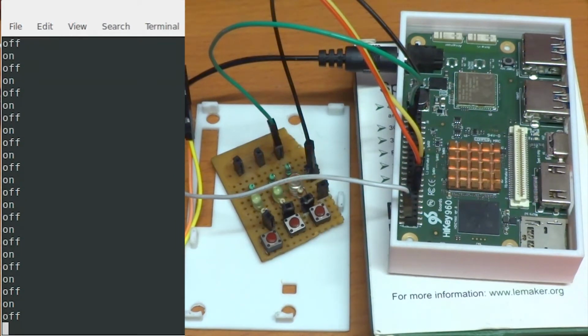Apart from that, if you're wondering how come the Raspberry Pi 3 has a 3 volt output, that is because the SoC is not that powerful. It's an old design and it works on 3.3 volts, although the cores inside of it still work at 1.2 or 1.8 volts. Now as silicon gets more complicated, the voltages need to be dropped, and the current rating also needs to be dropped. Otherwise electrons start skipping and heat starts building up a lot. So if it's built on a smaller manufacturing node, like for example 20 nanometers or 14 nanometers, you would not have a lot of voltage coming out of the GPIO pins.